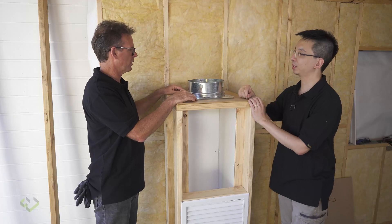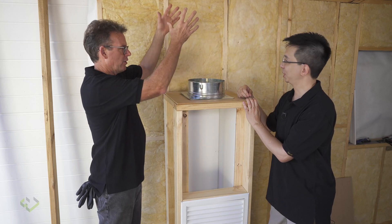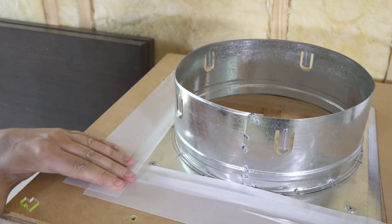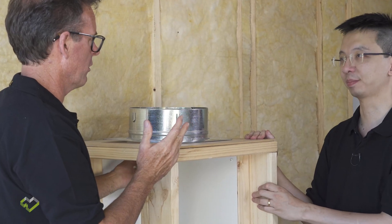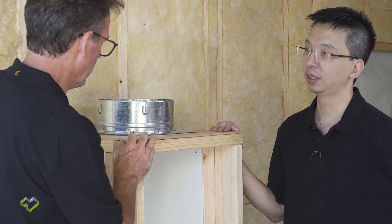The mechanical installer can have their ductwork attached to it — this spigot goes on top. This is not common practice, but your flexible duct hooks onto a spigot, the spigot seals to the cap, the cap seals to the framing. We've got internal lining, all mastic and caulk, top and bottom — very much like our internal plasterboard. Treat this like internal plasterboard: mastic at the corners, the floor, the internal corners, and all of a sudden we've got a sealed unit.